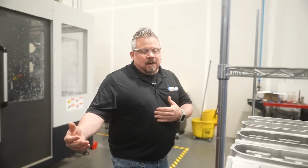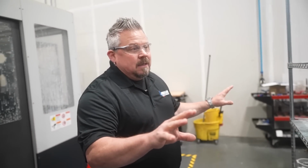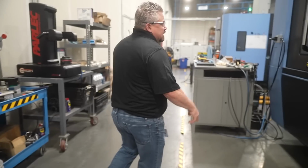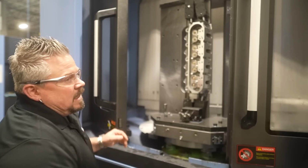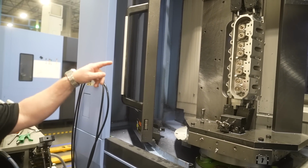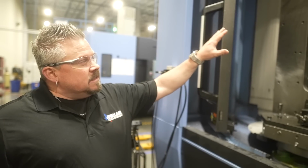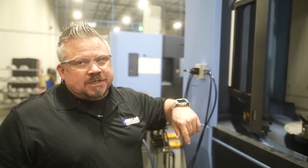What they do is on a job order, they'll pull so many out of that box and put them on a baker's cart, and then we run this set together and it travels through the shop. It looks like we're just getting started on this side here. Let's look at the back of the machine now. What's nice about the horizontal is while it's machining a head, somebody can load the next one, or we can install guides in the head while it's machining. So basically the machine never stops.